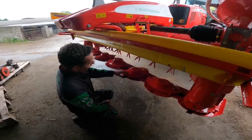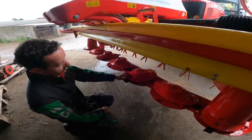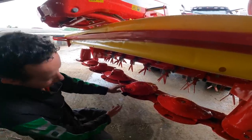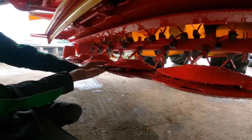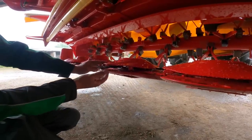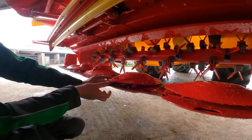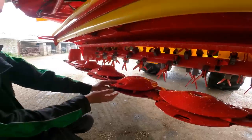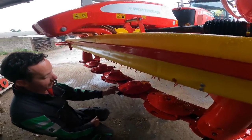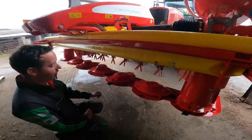With a 12 to 15 degree angle on your blade, the blade isn't coming into contact with the back of your disc, so you're not damaging the side of the blade that's not used. Another key feature of the disc is how the blade is held in — on an 18mm stud with 20mm distance. Your spring-loaded plate locks the blade up into place with a 20mm diameter, coming over the blade and locking it up against the bottom of the disc. This allows for 20mm of travel before the blade will come out, as opposed to designs where the stud is on the spring-loaded plate, leaving only the thickness of the blade before it may come out if you hit a foreign object.